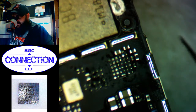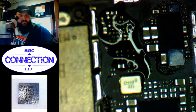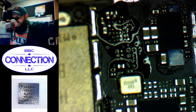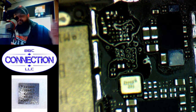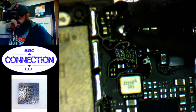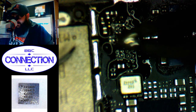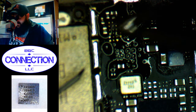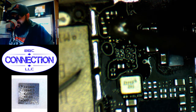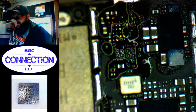Remove the heat sink. We got a little extra solder that came off — just clean that up a little bit. Now add some more flux and come in with solder wick to kind of clean up. You want to lightly touch the pads, don't push very hard or you can lift a pad. Move pretty slowly because you need to give the pad time to heat up and become liquid. If you don't, you can rip the pad.